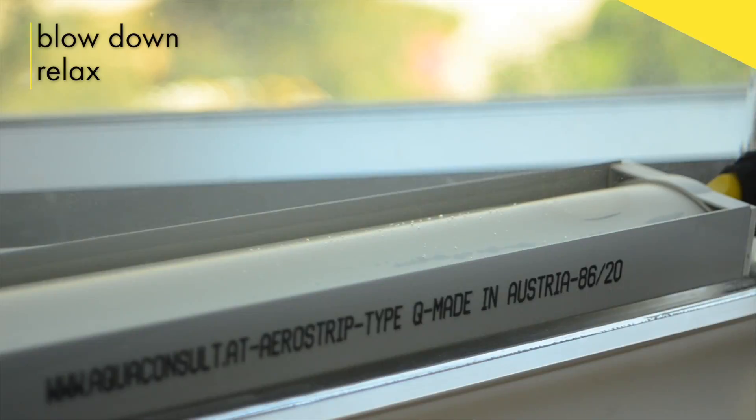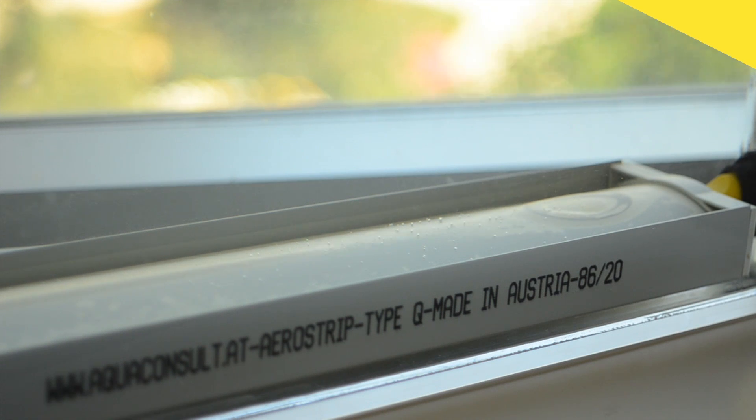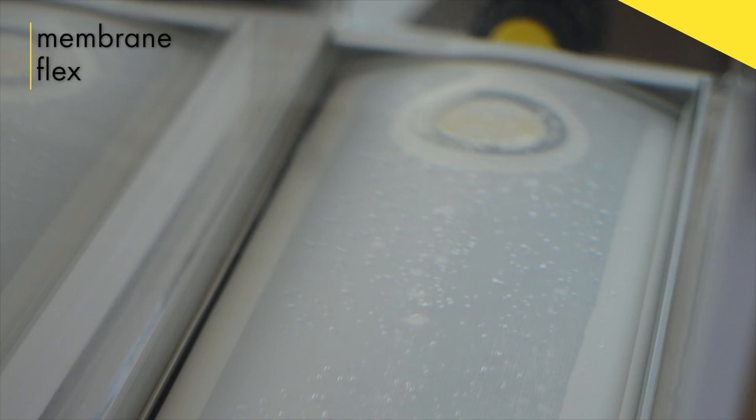When the airflow is turned off, the pores will close tight enough to prevent backflow of water into the diffuser. During the relax phase, a valve at the surface allows the air to escape and the membrane relaxes down onto the diffuser base. This method of relaxing the membranes prevents any condensate from being trapped underneath the membrane. After a short relax period, the airflow returns at a slightly elevated rate.